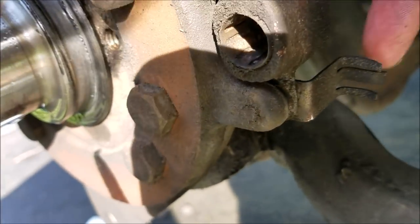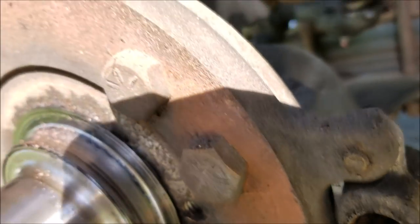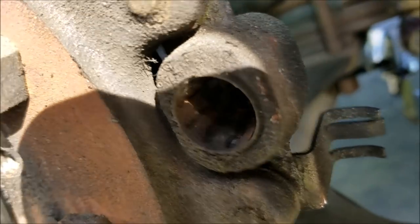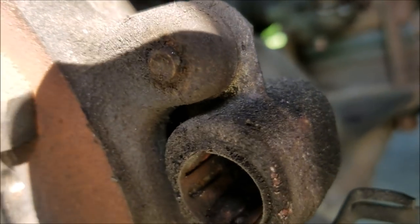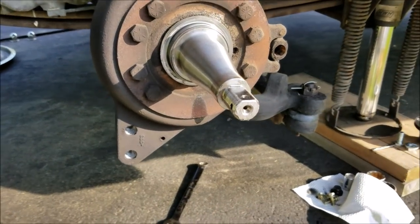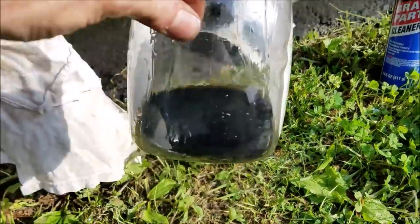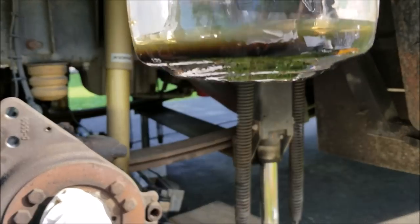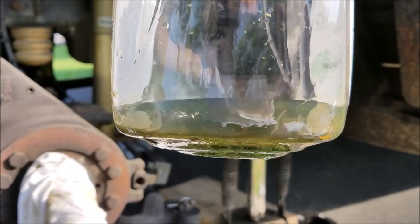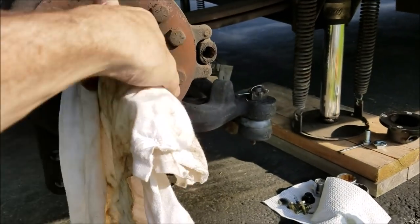There's something bugging me — I don't know what this is. It seems to have no purpose, just hanging there. That's somewhat of a mystery to me — unless it's for a tow wire, maybe, in certain applications. But I don't see that it has an application on the W24. If somebody knows, let me know. Well, they're calling for rain, so I've got a rag here — I'm going to wrap this spindle up, soak it in oil so it'll be protected. Remember, if you're going to change your oil in your front wheel bearings, it's one-quart 90-weight GL5 — I believe that's what they recommend. One quart will do both sides easy.